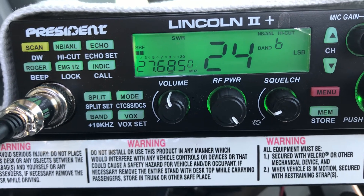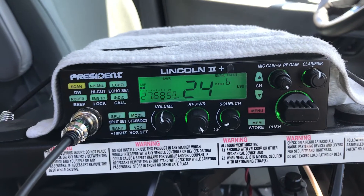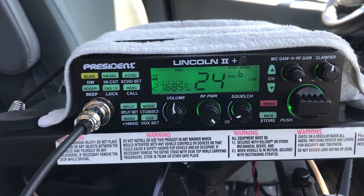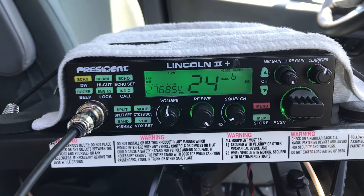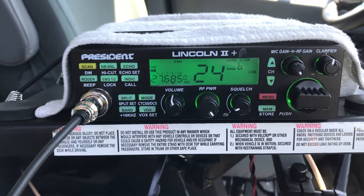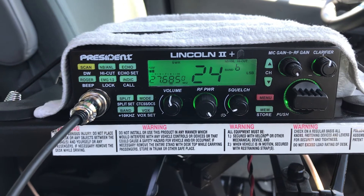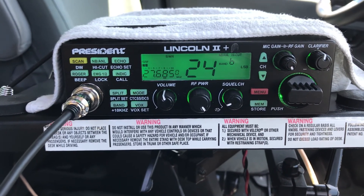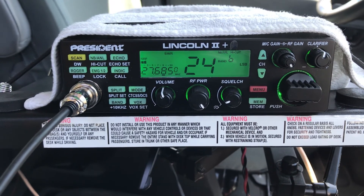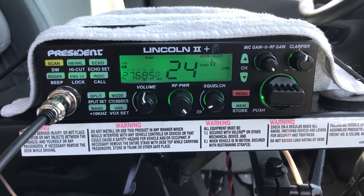Pretty cool design. Half-inch PVC, two caps, 3/8-24 thread bolt with a nut about an inch and a quarter long, and some 14-gauge coated wire — the kind you get at CarQuest or an auto parts dealer. Wrap it up about an inch apart, and when you get to the top make yourself a tightly wound coil about four inches, then start trimming off until you get your SWR where you want it. Have a good day — this is W4FFX.